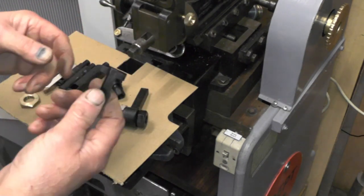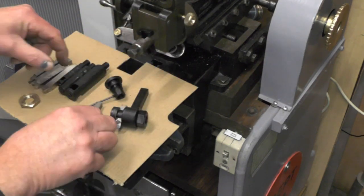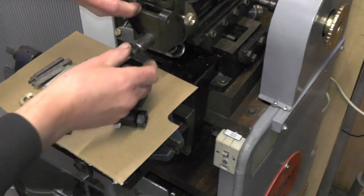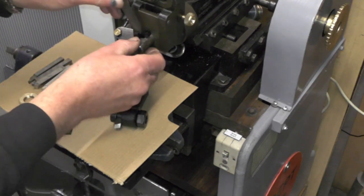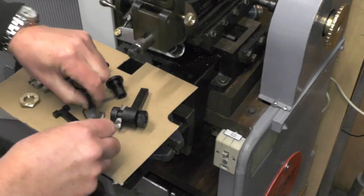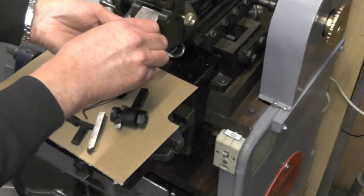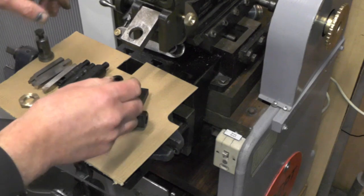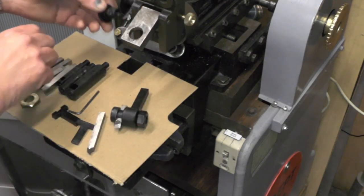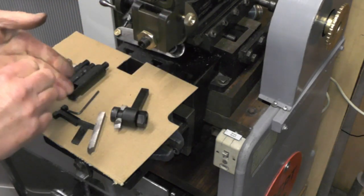I also got this tip off Rustinox — some supports for putting the tool in to give it extra support. That just slides into the tool holder so you can have your tool further through the tool holder giving it extra support. I've also made keyway tools or slotting tools — this just slides out of my tool holder on the clapper box, and I've made this piece that replicates that interface into the clapper box, fastening on with a nut.